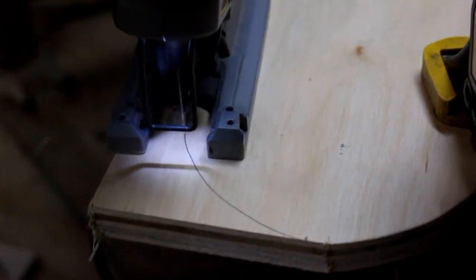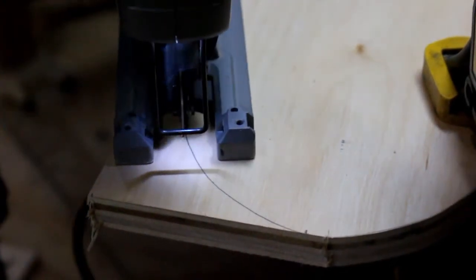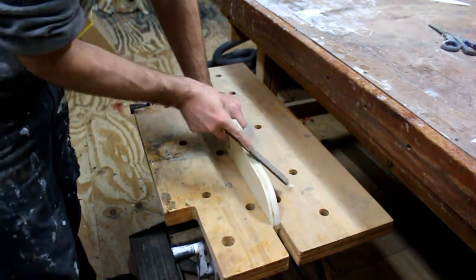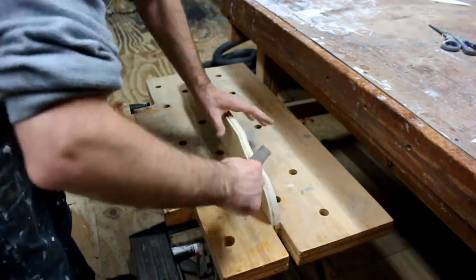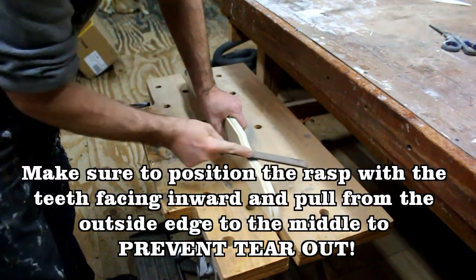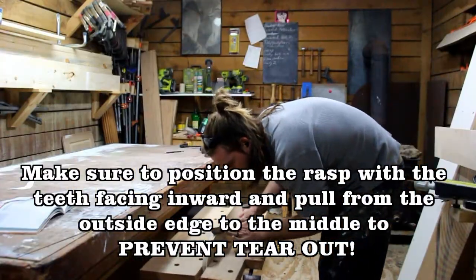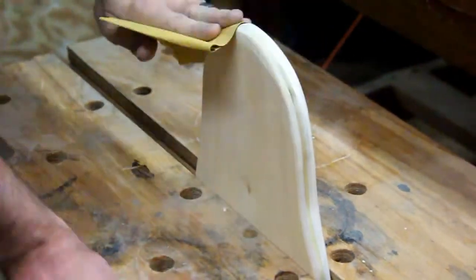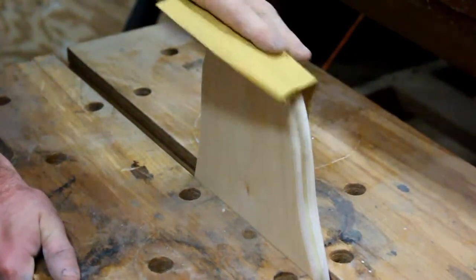Now it's time to cut it out — all that's required for this board is a jigsaw. When cutting your board out with a jigsaw, make sure that you're cutting just outside the edge of the line, because we're going to go back and reshape these edges in a minute. Don't cut exactly on the line — cut just outside the edge. Next step is to take a rasp and just clean up your edges and round them off a little bit. After that, grab your 220-grit sandpaper and sand all the edges until they're nice and smooth.